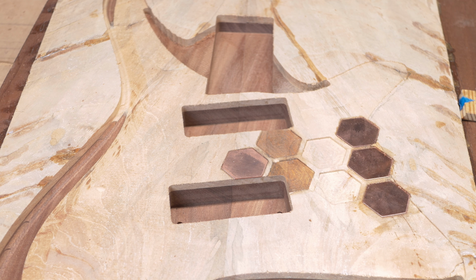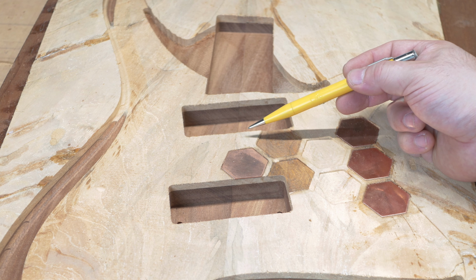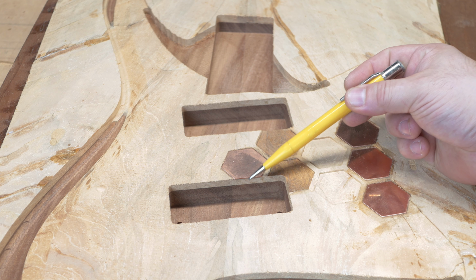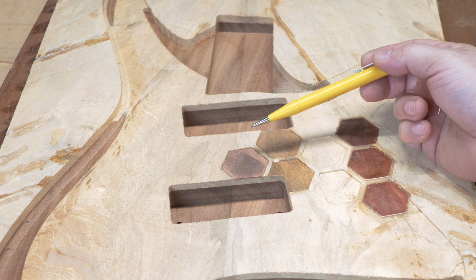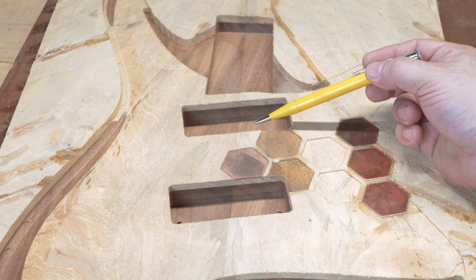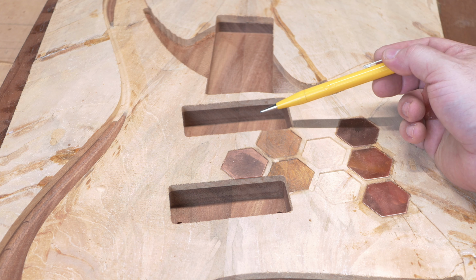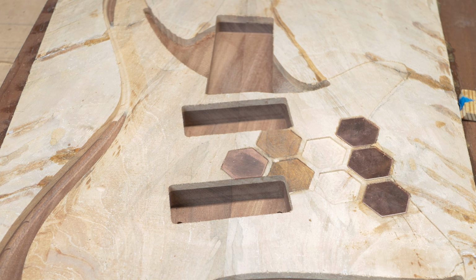The issue that I ran into was these decorative inlays popped out during the machining process. What you have here is wood and a tool path made for wood, and you're introducing a foreign material, which is metal, which requires a unique end mill as well as unique tool paths. I was essentially trying to be efficient and machining both the wood and metal at the same time, and it didn't work. What happened was the end mill grabbed onto it and just flipped it off.